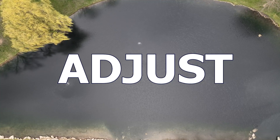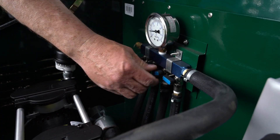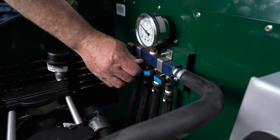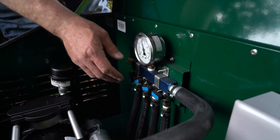At this point, if you've installed more than one diffuser, head back to the compressor cabinet for adjustments. The key is to equalize the airflow between the different depths and airline lengths. Based on visually inspecting the diffusers at the water surface, equalize the airflow so they look similar between each diffuser. When your diffusers are in place and equalized, add soil back onto the airline so they are out of the way and safe.